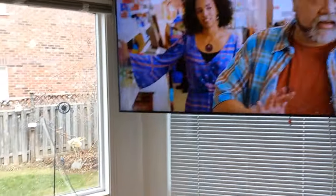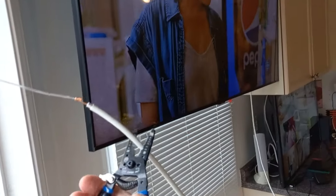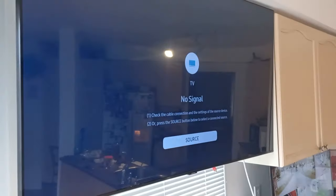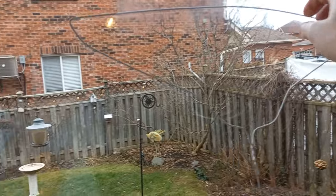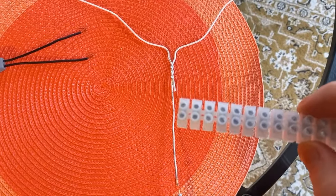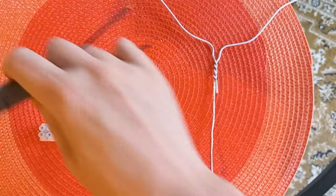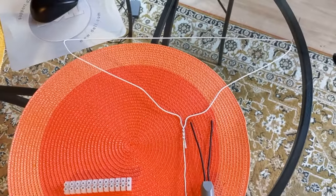So what I'm going to do next is cut the coax just so everybody can see that this is the real deal. I lost the signal - so that coat hanger was actually doing the work and picking up the signal. Let's bring it over here and improve the antenna. It worked pretty good the way it was but we got five channels - let's see if we can get more. I'm going to cut it there and there, put a terminal in, and put a balun in to give us a balanced signal. The more proper way of doing it.